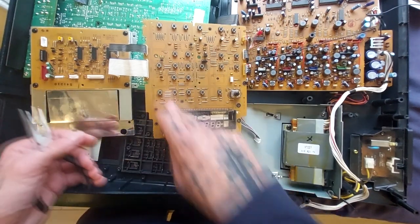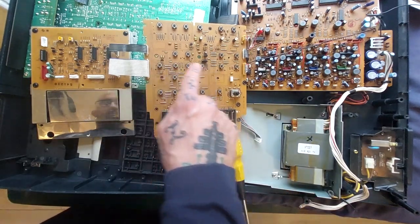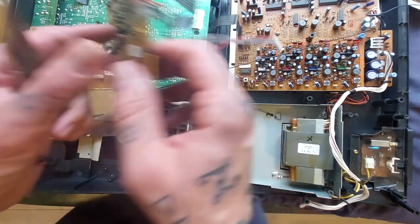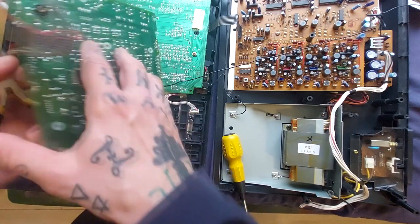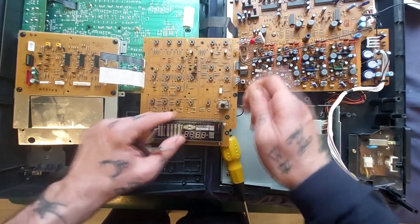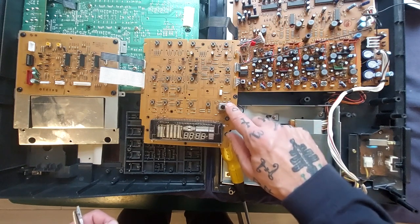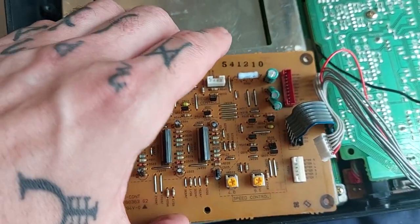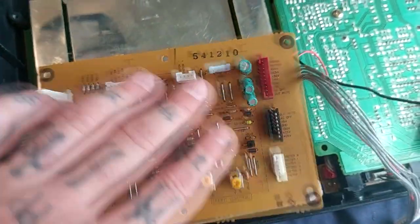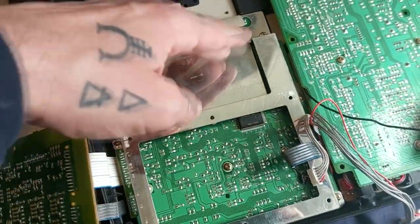You can see this is quite dusty despite having plastic buttons over the tactile switches — quite often these will stop working. Cleaning them with compressed air and contact cleaner, repeatedly whilst agitating the buttons by pressing them, can bring them back. Sometimes there'll be little cracks in the solder at the base of the tactile switches; sometimes you'll need to replace them. Also, this pitch control pot is mounted there — if that's dirty you can get little intermittent changes in tape speed. So you'd want to get in there, specifically that recess: compressed air, then contact cleaner, more compressed air, then a lubricant.